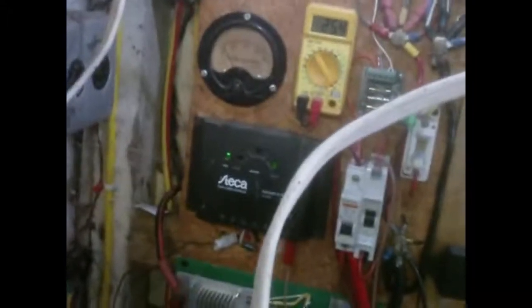So of course, the first port of call was to replace this. I thought I might replace this, but that's a bit of a pain in the ass. So before I did that, I thought I might just see if I can solve the problem. And I figured that if there was interference coming from the battery lines in, which come in here, maybe I can put a component there to suppress it. Initially I thought of an inductor in series with the line, and then I thought, well, it'd be easier to try a capacitor, wouldn't it? So guess what? That's what I did, and look what we have. This little baby capacitor is making a huge difference to the charging of the batteries, because now this thing PWMs and it doesn't skip a beat.